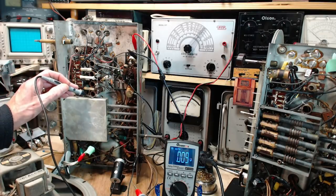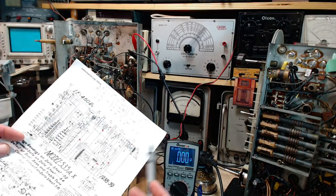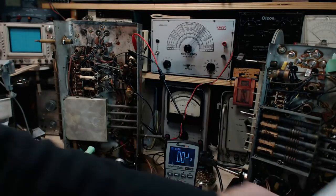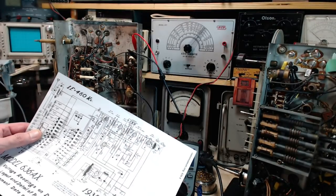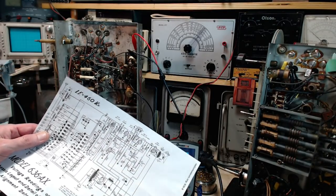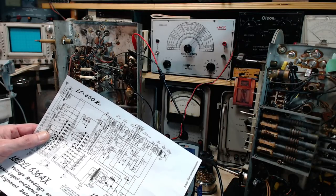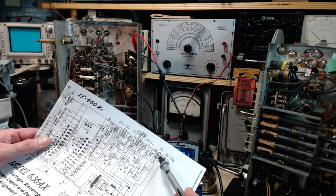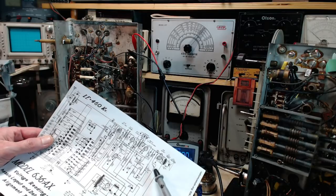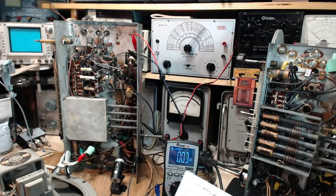Practice first, so we're going to go from... We should try to go across that resistor, come to think of it. It's really the same as chassis. No, negative bus. Yeah, not the chassis. We want to go from the negative bus. Here. But actually the voltage that's of interest is from chassis to here. We'll do them both if we can.